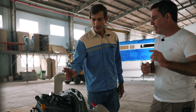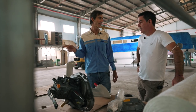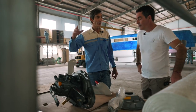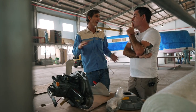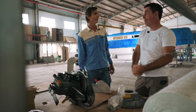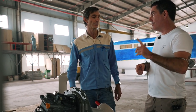They've now added a tube which allows you to draw out the oil using a hand pump — a really big improvement. This is important because on our last boat the Yanmar maintenance schedule required a gearbox oil change after just 50 hours. The engine and gearbox are done at the same time — 50 hours is the break-in period, then every 250 hours or one year. The 50-hour service was always a problem because it was never when you wanted to haul out. Also, to maintain the warranty you need a Yanmar-accredited engineer for the first service.